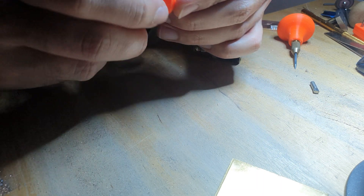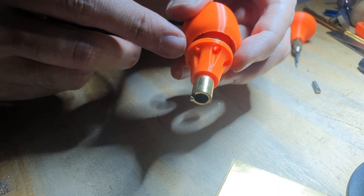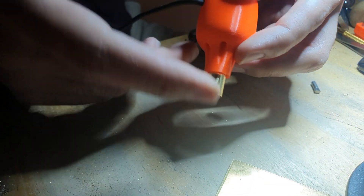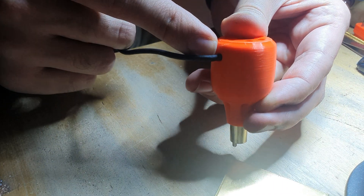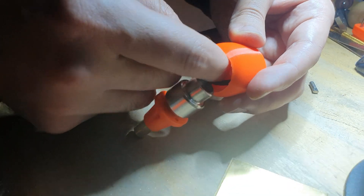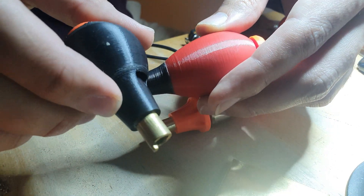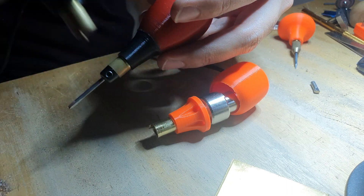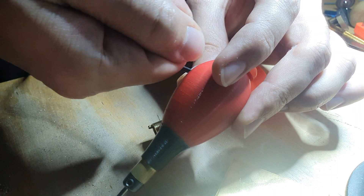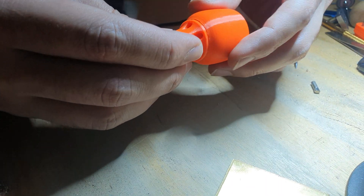This is the brass collet — I have a video on how to make it. You just put it inside and apply some glue. I use cyanoacrylate glue, or for the final design I go with epoxy resin. After assembling, I put some weight to hold the wire in place. I thread the wire through the opening. For other handpieces like the 1642 and the AliExpress solenoid, the opening is smaller, so I make a hook from metal, insert it, loop the solenoid wire, and pull it outward.